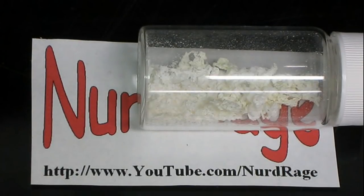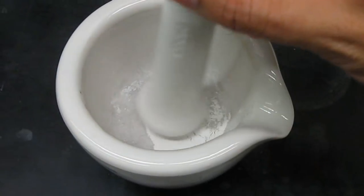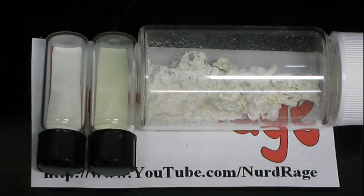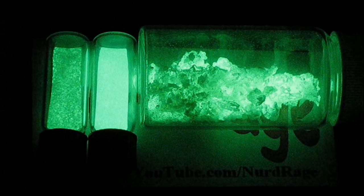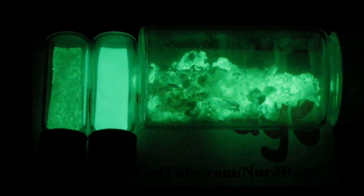Now for the most important analysis: the longevity test and comparison to commercial glow powder. I have my best sample on the right, and commercially available glow powder on the left. For a fair comparison, I crushed my powder to an equally fine consistency. After charging all powders for 10 minutes with UV light and killing the lights, the glow lasts about 10 minutes of bright glow, with several hours of dimmer afterglow my camera can't record. My powder falls short of the commercial powder overall, but some individual flakes are just as bright and last just as long — the issue is non-uniformity and dead flakes reducing average brightness.